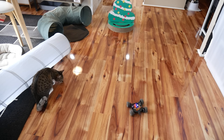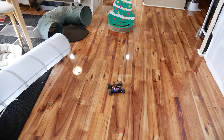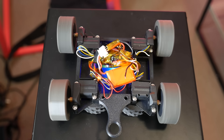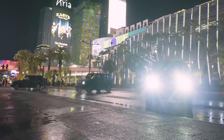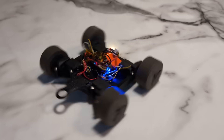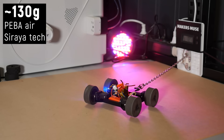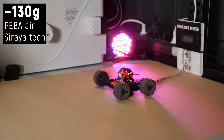When it comes to performance as tires, it's not bad — the robot felt like it had good control and maneuverability, feeling just slightly less grippy than the TPU Air tires. Where it strongly differs is when turning on the spot via skid steering. This four-wheel drive platform can only turn by adjusting motor speeds on each side — the same concept as a tank. With the PEBA Air tires, skid steering causes a weird bouncy vibration resonance that the TPU Air tires don't exhibit. On the test bench the PEBA Air tires pulled a consistent 130 grams — only 10 grams lower than the TPU Air tires, but the difference will widen as drive motor power and speed increases.